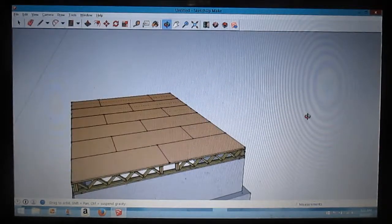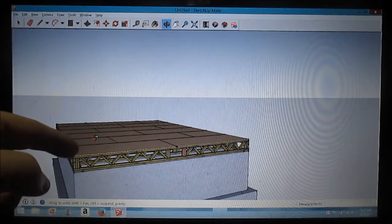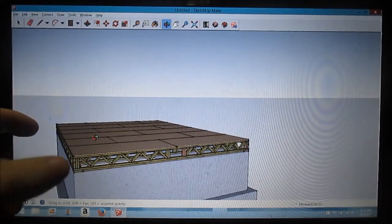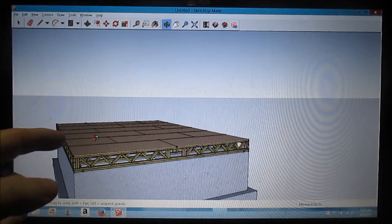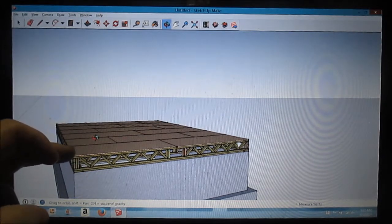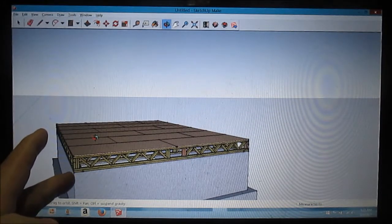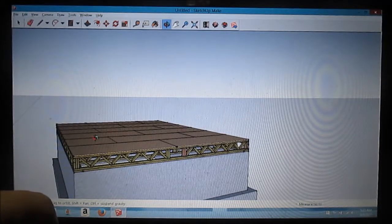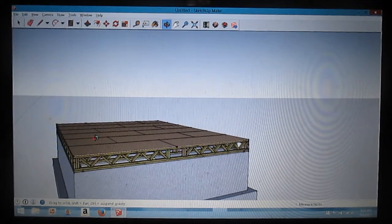I'm gonna make this a panelized wall system. I want to lay this out and build my long walls first — my load bearing walls. They're going to be 24 foot worth of wall panels, four foot each. I want to set my sole plate right here, then have a wall panel with sheathing coming down past it and up, and I'll make a spot for trusses to have a heel. But right now I'm gonna build a wall panel — let me show you.